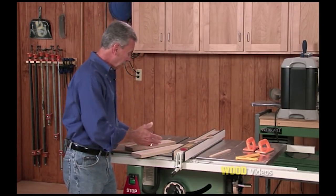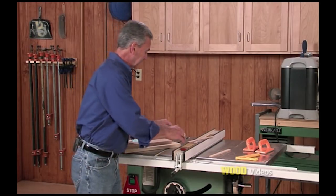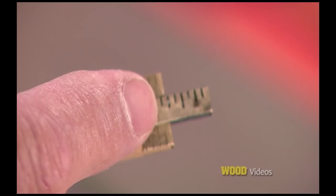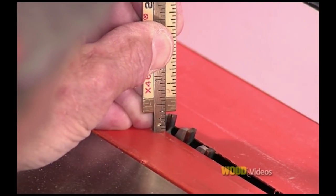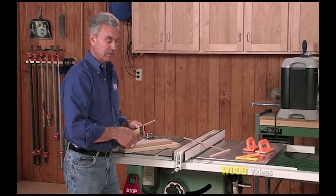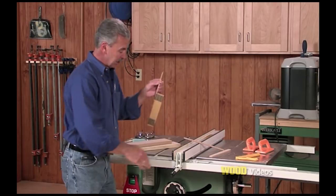The basic tenets are still the same — find the nicest faces of these boards and put an X on them. I know these boards are three-quarters of an inch thick and the spline is three-quarters of an inch wide, so the first thing we'll do is raise the table saw blade three-eighths of an inch. I know the spline material is three-quarters of an inch wide, so I'd like the center of that blade three-eighths of an inch away from the fence. Using the same measurement, I'll slide my fence over until it aligns with the center of the blade at three-eighths of an inch away from the fence.